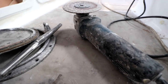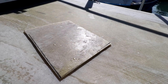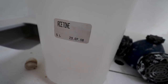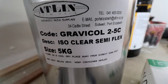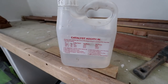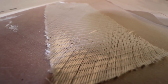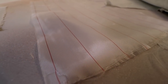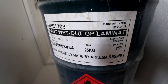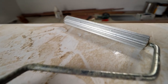What you will need is an angle grinder with a 24-36 grit sanding disc, a piece of laminated fiberglass or wood, something to suck or sweep up the dust, some acetone, Gravacol slash Ultra Bond, the catalyst for your Ultra Bond and resin, some fiberglass, peel ply, polyester resin, an aluminium roller and a paintbrush.